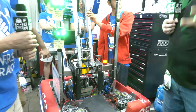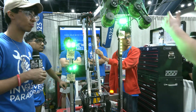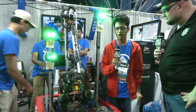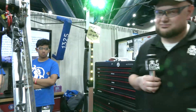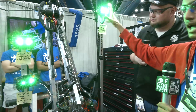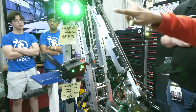It's been working out great — your team is doing so well. I love the gas shock; I don't get why more teams aren't using it, especially this year. Now let's talk programming. We have three Limelights, so let me go over each. The Limelight 3 targets the mid cone nodes as well as the left AprilTags, so when we're aligning at the start of auto in front of a cone node, we can align properly. On the red side without this we wouldn't see that cone node, so this covers that. It also manages high cone target alignment — both using retroreflective tape.